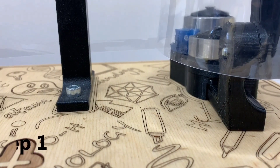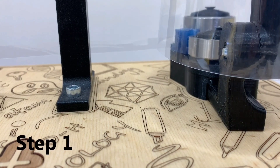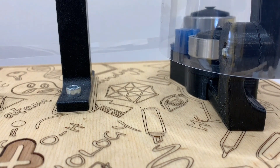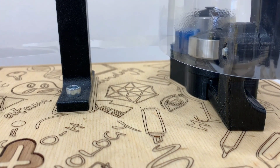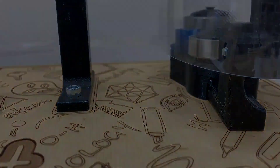At the first stage, the bottle is being cut into a ribbon. The sharpened bearings I use here do a great job. You can practically recycle bottles of any size. For example, we have lots of 5-liter bottles and you can even use 0.5-liter bottles, but of course you get less filament out of them.